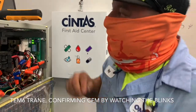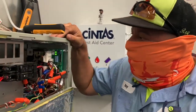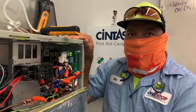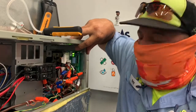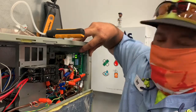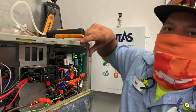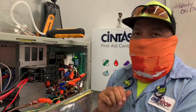We just finished touching on adjusting fan speeds. Another way you can confirm that your blower is near what you've adjusted to the compressor itself is by looking at this top light right here and the way it blinks. Counting each light when it blinks, you can count 100 CFMs per light. As many times as this blinks, it gives you the amount of CFMs this blower should be producing when you set it up.